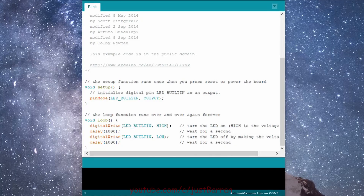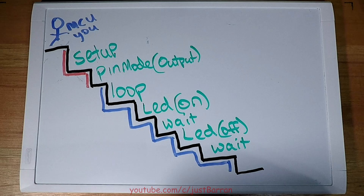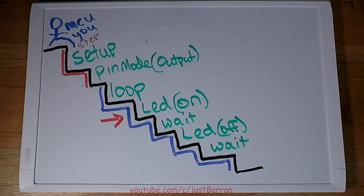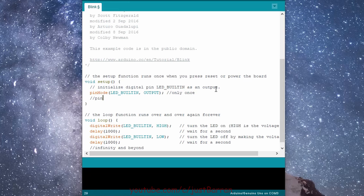Now let's try to understand what is going on here. Like most computers, a microcontroller can process information faster than most humans, but they are only as smart as the people who program them to be. With only one CPU core, most microcontrollers can only do one instruction at a time. Looking at an Arduino sketch, we have a setup function — void setup — encased by curly brackets. This is where we put setup instructions that will run only once when the board is powered up or reset. After this is a loop function that runs to infinity and beyond. The code is executed similar to you walking down a staircase — while you rest your foot on a new step is like the microcontroller running an instruction. Just like the microcontroller, you take it one step at a time.